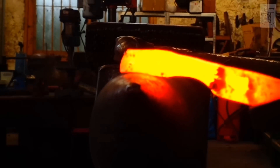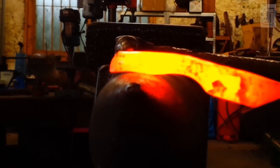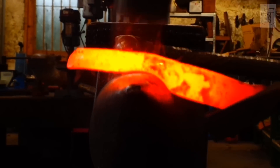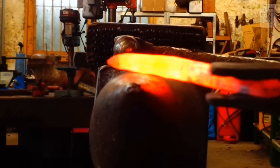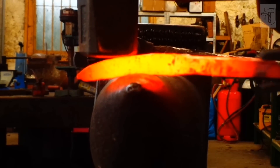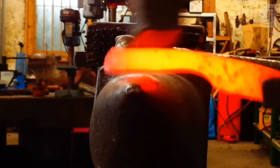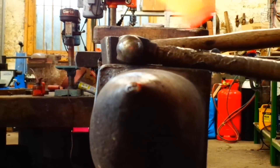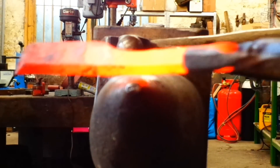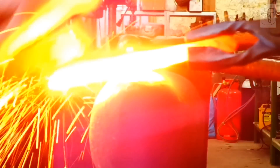I'm going to do this in one heat, so start hot — this is just to show that it can be done. I'm using a reasonably heavy hammer and just drawing it out over the bick. You can see how easily the metal draws out over the bick. Keep spinning your work to make sure that you are forging all four sides evenly. I'll get the appropriate tongs for the section I'm holding, and do the other side — you want to leave an apex in the center of the bar.